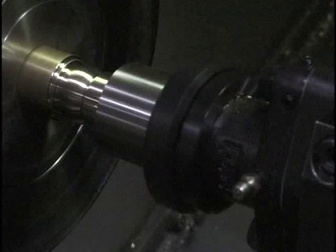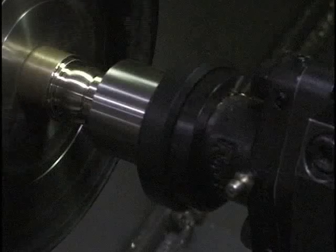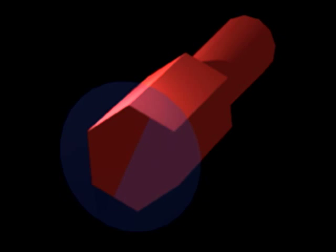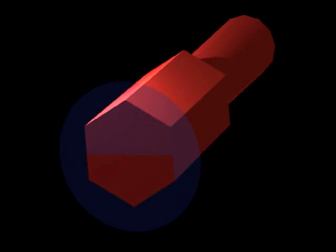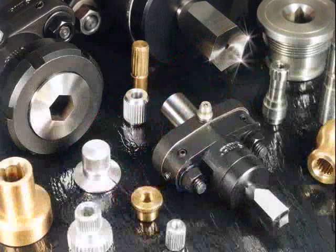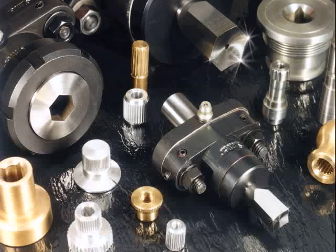The tool holder is mounted stationary, while the internal live spindle, along with the end-cutting broach tool, rotate with and are driven by the workpiece rotation. While rotating with the workpiece, the end-cutting broach tool's pressure and contacting points are continually changing on the workpiece, producing the shearing action, making broach forms easily produced.